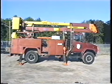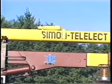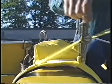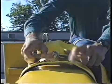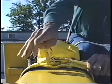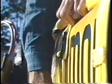To attach the rescue kit, position the bag on the top of the boom seven feet from the bucket axle. This distance may vary on some aerial devices, so check your user guide for more information on positioning the bag on your aerial device. Pass the top strap around the boom and feed the end through the ratchet. Operate the ratchet until it has pulled the straps tight. The snap strap can be secured using the snap and then pulled tight.